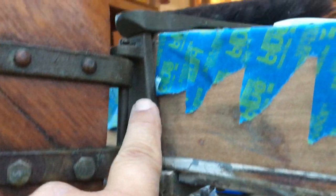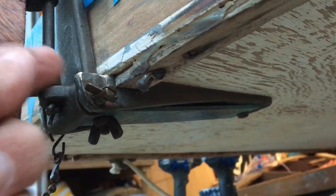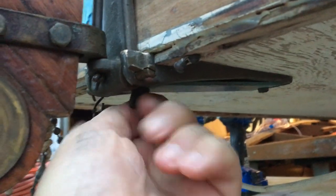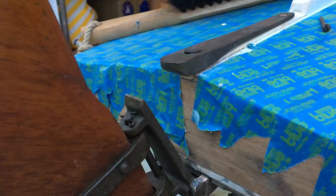The vertical plate goes into a little depression — this is called the latch plate. So the idea was, if you hit something submerged, it will pull tension down on this plate here, let this latch plate go up a little bit, and the rudder will pop out. Right now I've got it tightened up real tight with the little wing nut there, so if I try to pull on it, it doesn't pop out. But if I loosen it up one, two, three half turns, now I pull on it and it pops out.